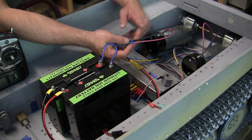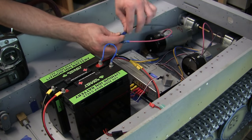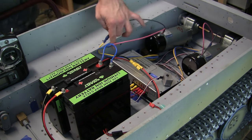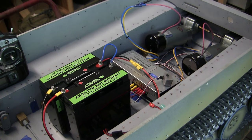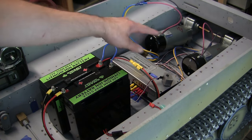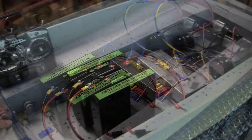It's just a simple switch. You clip off the one connector and solder on a male connector in place of the female. This is done to both motors. It's a very simple procedure. Once done, your motors will now be compatible with the current Armortek electronics.